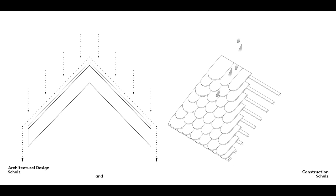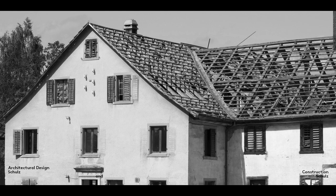Pitched roof coverings always operate on the diversion principle. They're made of a series of small components that overlap from top to bottom like the scales of a fish. Non-overlapping joints must be covered to ensure that water running down a roof surface does not flow into the structure itself. In contrast to roof waterproofing, however, the covering of a roof is not watertight. Strong rain and wind can therefore drive small amounts of water behind the covering, from where it must be carried away in a controlled manner.